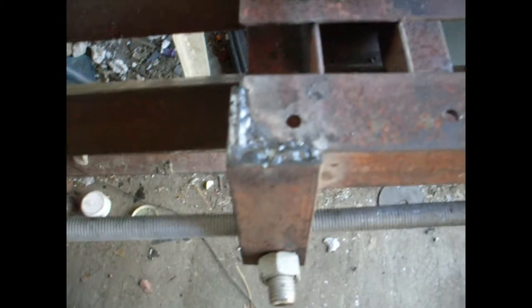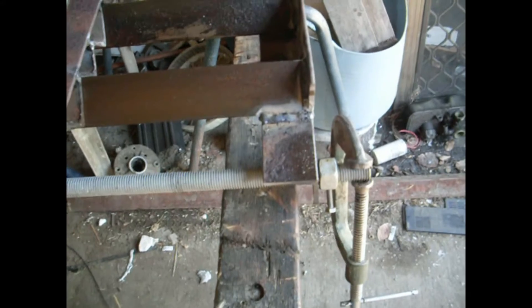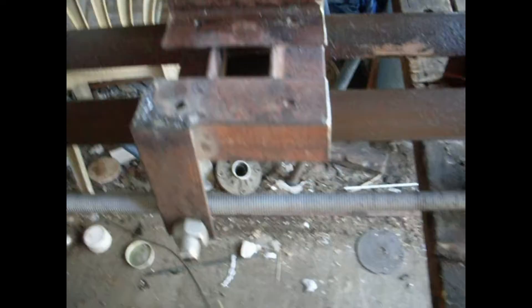What I'm going to do is change this — move the threaded bar from here on the side. Looks nice and convenient out the side like all other lathes, but I think I'll move it to under here, at the back of the lathe. The threaded bar will go through here, right up to the middle, so it's actually pulling from the centre of the saddle, and hopefully it'll hold the saddle down.